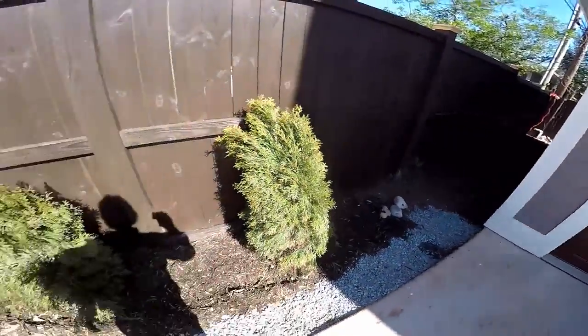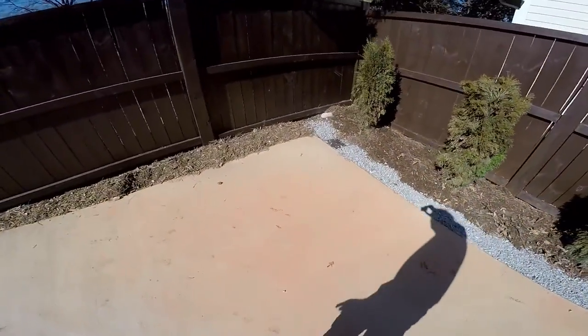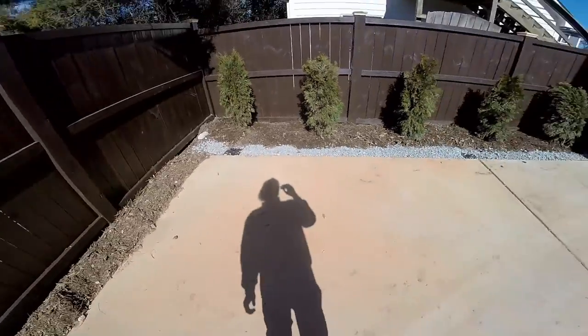Our discharge is of course the sump pump. We had to make sure we had a really good pump — we put in an M98, half horsepower, about 80 gallons a minute, and it should keep up with this quite well.